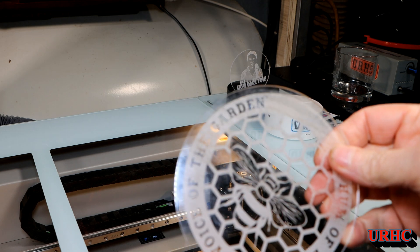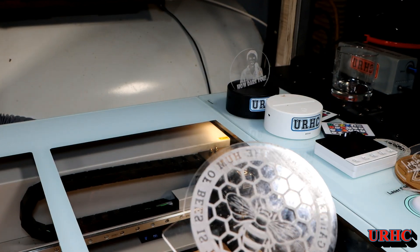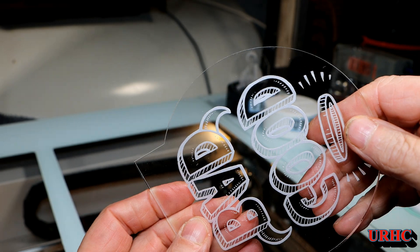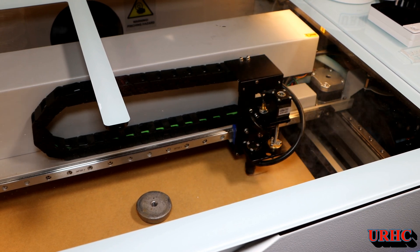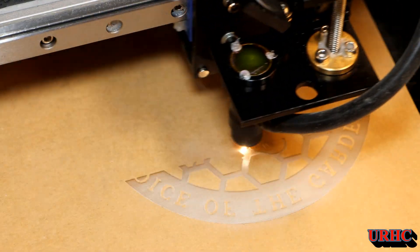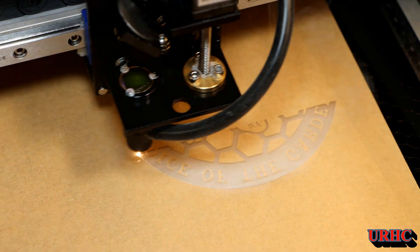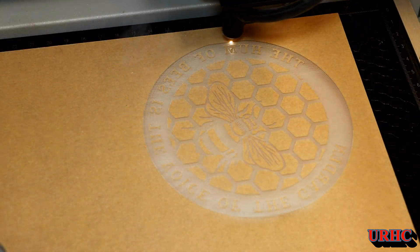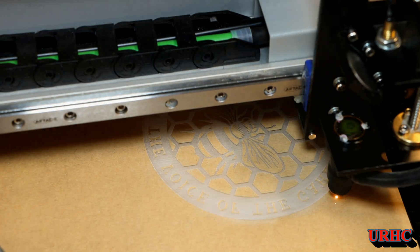You always flip your artwork and engrave on the back side for these lights. Here's a good one I'd done previously — you can see how clear that is and how you can barely see the lines, because they're going in the vertical direction. Now I'm doing another one: I've turned the sign sideways and I'm getting a really nice deep clean engraving. I'll just blow that little bit of dust off with the air hose at the end to clean it up.